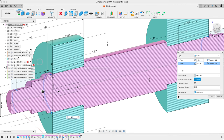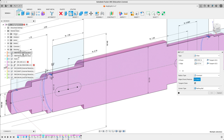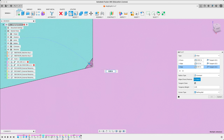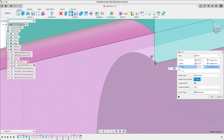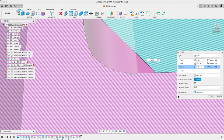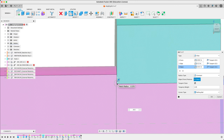The hub is blocking that curve. So let's deselect those two and pick a new one — go for plus there. Turn the hub back on. This is plus, 0.2 there. Let's go for 0.015. That's the best we can do with it. Turn off the preview — that looks right. The sketch might be getting in the way. So we've got a correct result: we're now down to the micron level here, but we've got good surface roughness. That's about the right size. It's an artifact of the resolution of the part.